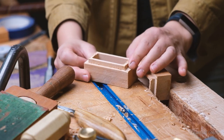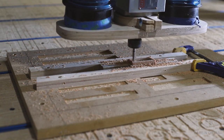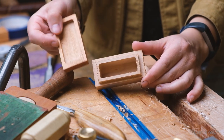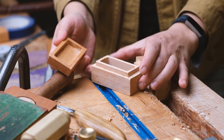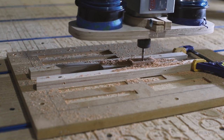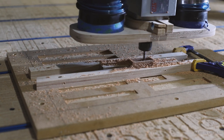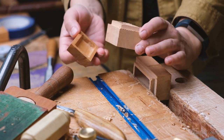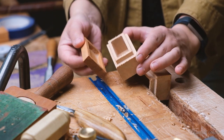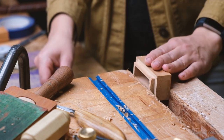This is what it looks like when it comes off the machine. We use a quarter-inch end mill — a spiral up-cut bit — which means the shavings come out upward instead of being pushed down, which is important; you want to bring material out, not suppress it. It has a little lip around the edge. I like this design because you only need wood — no additional fasteners or hardware. You do need a precise fit though: the depth of the hole is one inch and I made it in 10 passes to make sure I didn't blow out the lip. These are two separate pieces cut at two separate times, which is why it's tricky to get the position just right, so I make it slightly bigger than needed and finish it off by hand.